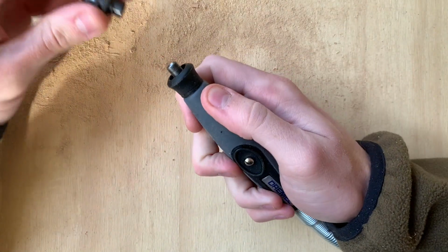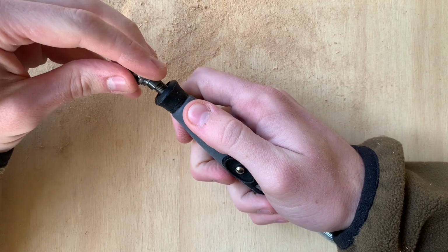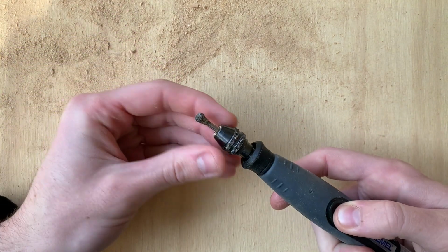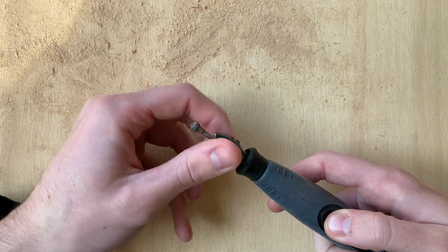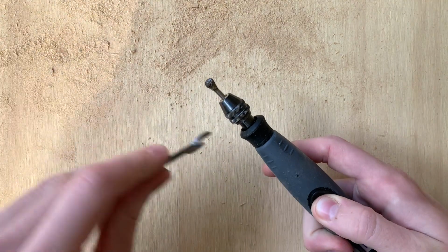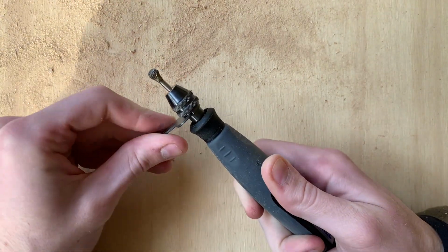At the working end of the Dremel, you can screw the collet back on loosely and then add your attachment. Once the attachment is in, the only button on the flex shaft acts the same as the lock button on the Dremel. So hold it down as you tighten the collet and keep holding it down until the attachment is well secured by using the wrench.